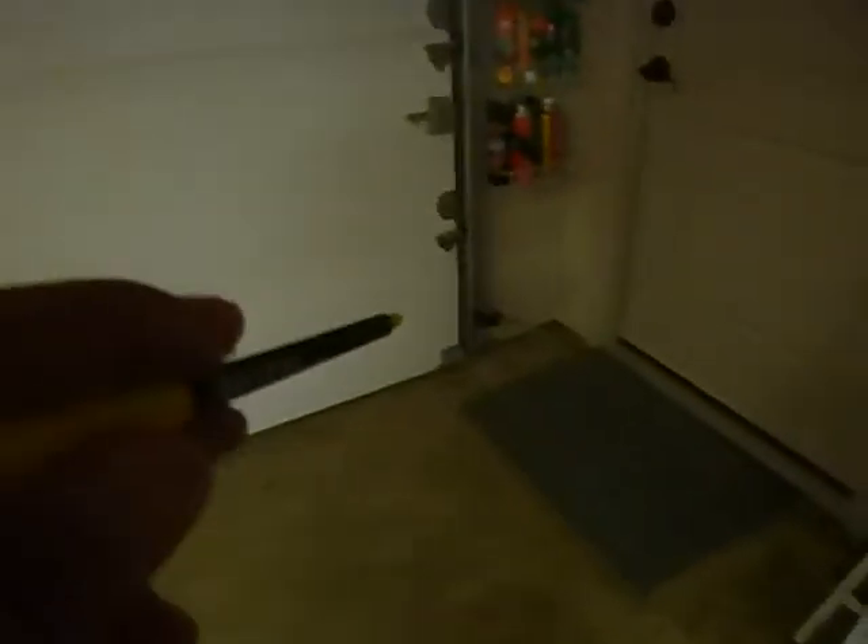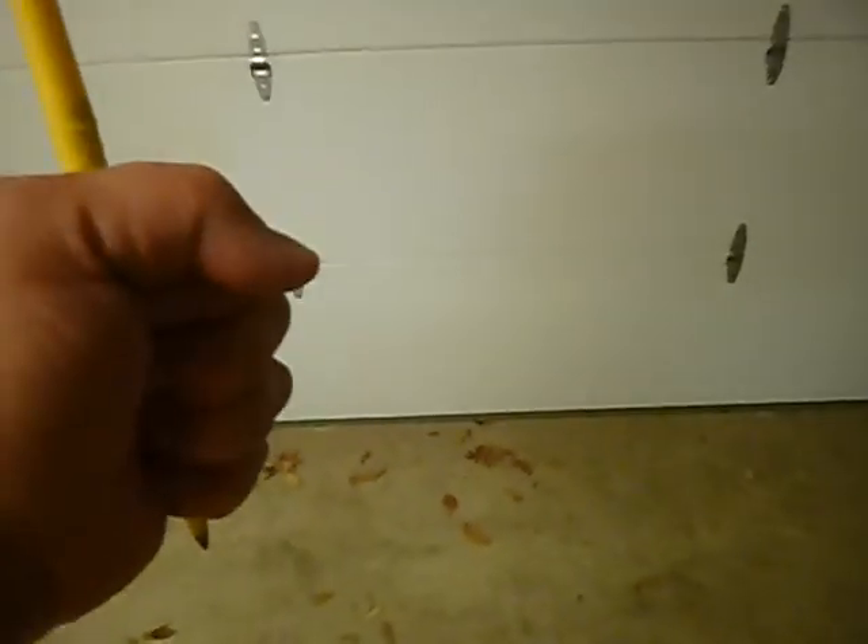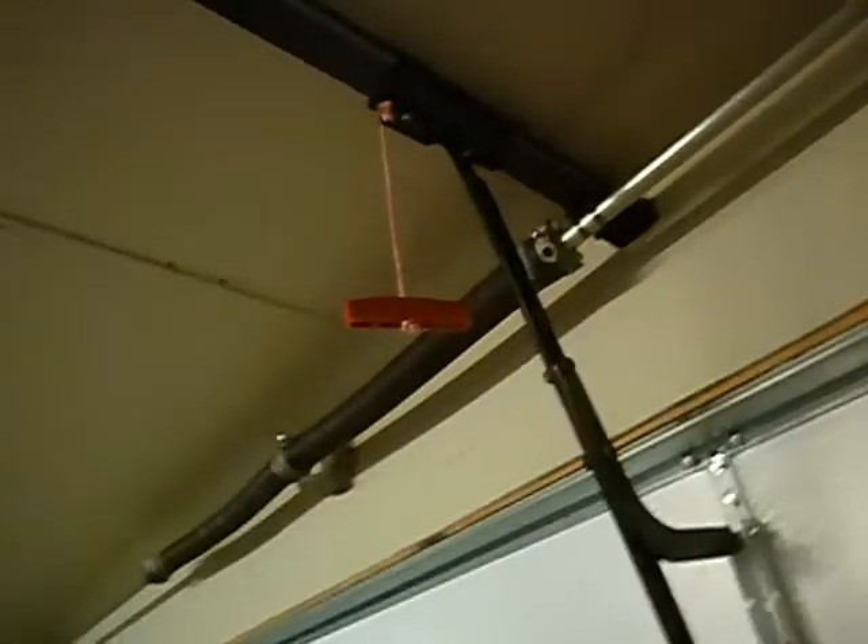The first course of door panels — the bottom ones — should have a spring tension notice on each corner. Somewhere on this door it should have a child safety notice. And there should be a handle inside the door so that you can pull it up if you need to disengage it in an emergency — maybe because your optic sensor is too high and you're squashing the cat.